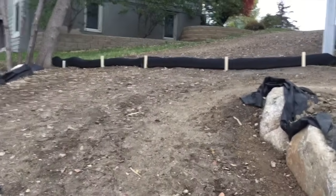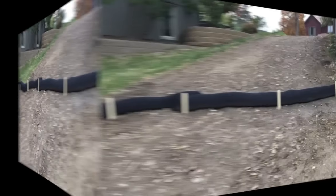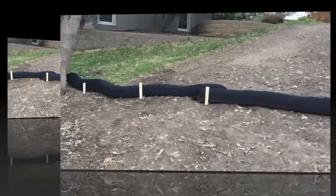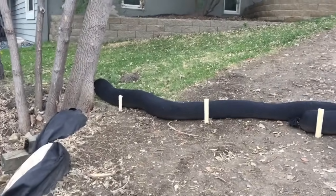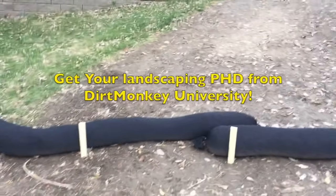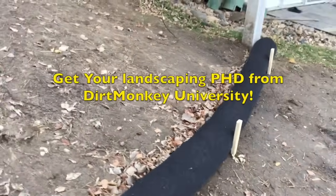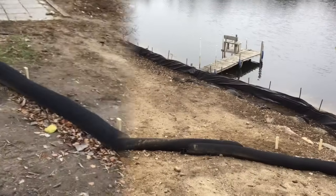If you can't drive a silt fence in place, dig it and toe it in. Another option are bio logs. I recommend staking them in, otherwise they can wash away. You can stake them on the downward side, or you can drive a stake physically through the bio log. I don't prefer to rip the fabric at all — I've seen it done, but I like to keep it whole and intact. I don't like to drive a stake through it if I don't have to.